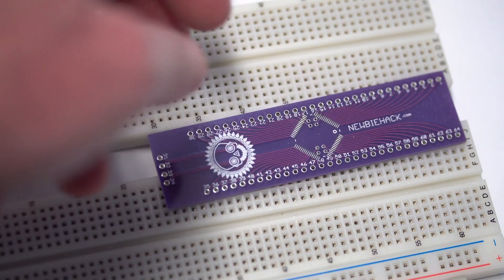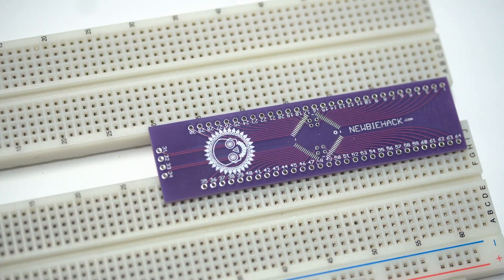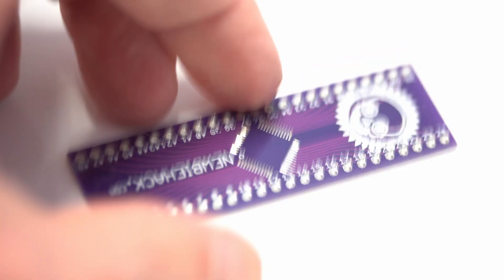In the case of that alternative you can plug in two of these boards like this. You don't actually have to use a 64-pin microcontroller — you can use other packages. You'll just have to find the breakout that's necessary for that particular microcontroller. It doesn't really matter which STM32 microcontroller you use. There are going to be some differences with the data sheets and the reference manual, but since I go over all of the features in the data sheets and reference manual, you'll know exactly where to go to make any changes necessary.